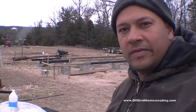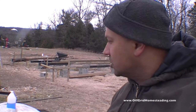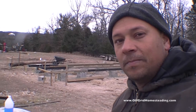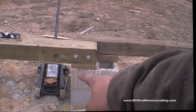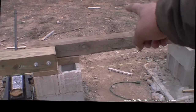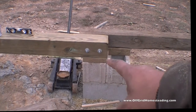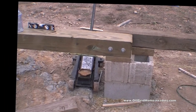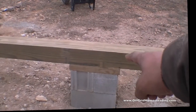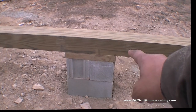So let me just take you on a walk over there and show you what I've done so far, then I'll put the camcorder on time-lapse again and just let you watch for a while. I've got probably another hour of sunlight or so to go. These two shims that I made right here I had to redo because this beam here wasn't level — this one was a little bit higher than it should have been, so I had to shave those down slightly.